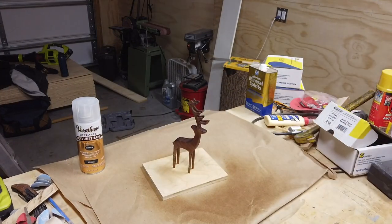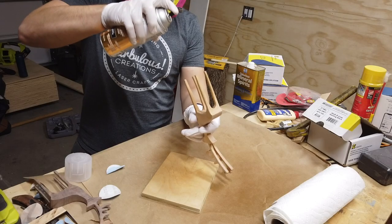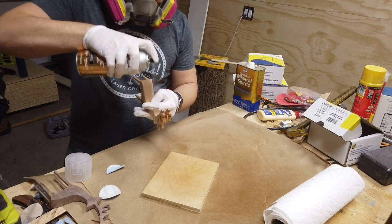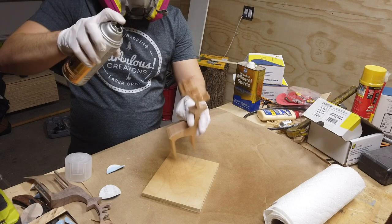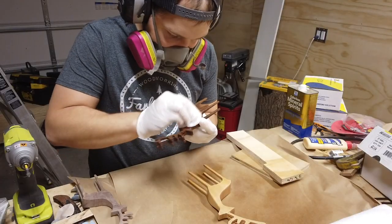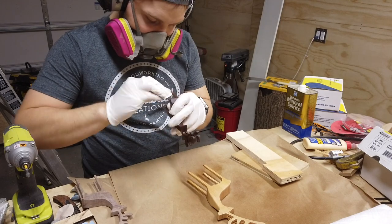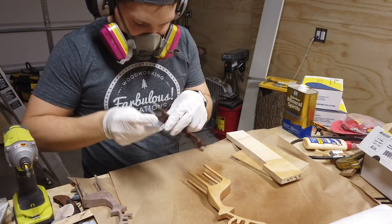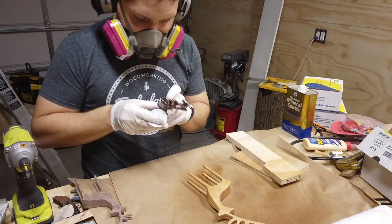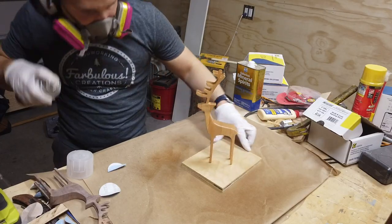For the initial coat, I set each reindeer on a scrap piece of plywood that I could rotate on my bench as I sprayed finish on each side. On subsequent coats I began by holding the reindeer in hand as I applied finish to its belly and antlers — both areas that were a little hard to reach when he was standing on his own four feet — before setting him down and proceeding as usual. My finish game isn't the strongest, and I had some drips after a few coats from applying the finish a little too heavily. Lighter coats are always better. So after my third coat had properly dried, I performed a good hand sanding with 220 grit sandpaper, making sure to level out any drips from the polyurethane. After dusting it off on the air compressor again, I applied a fourth and final coat to each reindeer.